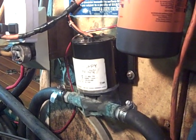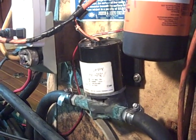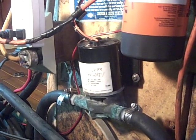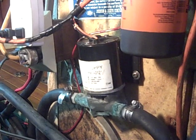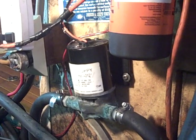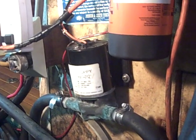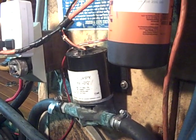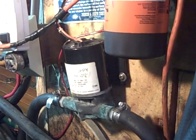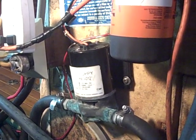If you've ever been out to sea and had to change an impeller on a mechanical pump on one of these engines, you're in for an upset stomach. There are other advantages too. Earlier we showed you turning off the ignition — when we turned off the ignition, we turned off the electric pump. The engine is still running, and while it's running and not getting water, it's pumping out the water already in the system. This keeps your engine dry of salt water.